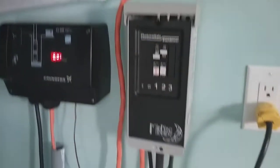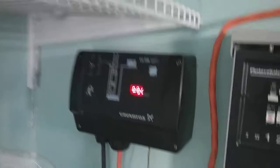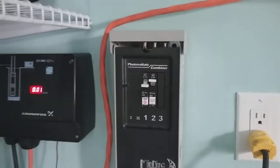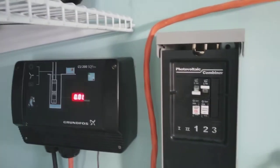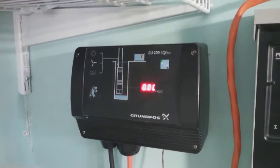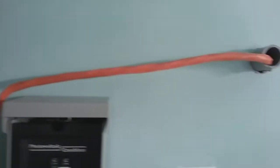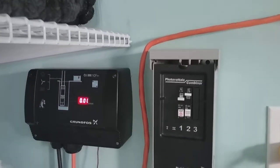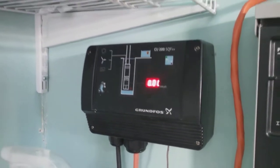Okay, I'm in the office now. There's the Romex wire — it's just hanging out because I want to have a shelf here with electronics on it, DC-DC converters for the well. Right now the four solar panels are wired in parallel into this brick box right here, and it's 35 volts, which is not high enough voltage most of the time to run the well. So I want to have a buck converter to step down to a constant 12 volts to power lights in here, and then a boost converter to boost up to 40 or 50 volts so the well will run a lot easier.